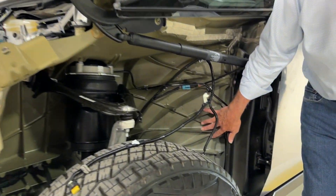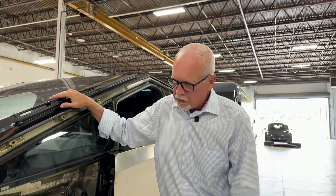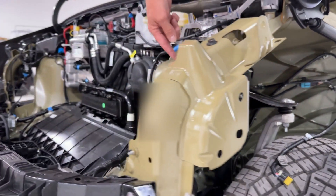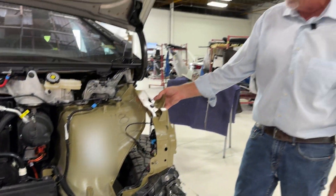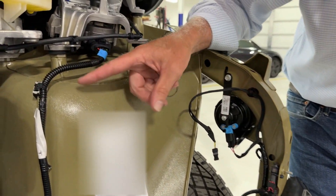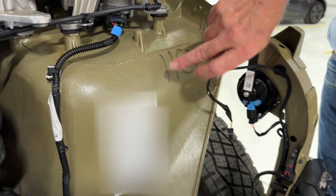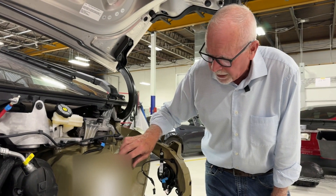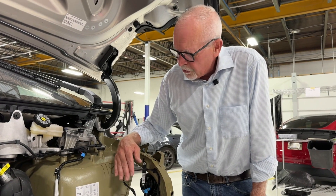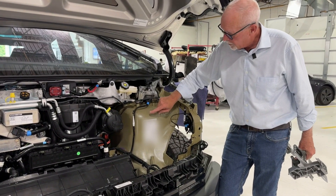One piece of die-cast alloy for the whole front section. You've probably heard about the unboxed manufacturing process where things can be assembled in components, but what a giant giga casting — all the way across the front to the other side, one solid piece of cast aluminum. The quality of the giga casting is the best I've ever seen. Like any die-cast piece there's a little flaking from the mold itself, but they've come a long way — molten alloy under high pressure means no voids, no air pockets, no fracturing or cracks. Really impressive quality.